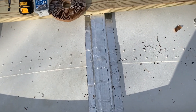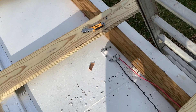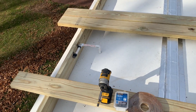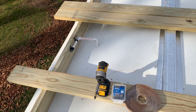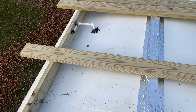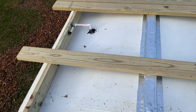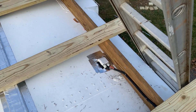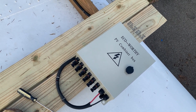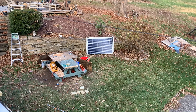It has butyl tape underneath and roofing screws, and I'm also putting a layer of roofing tape on top to seal it in. Should be watertight — hopefully. Then I've applied Henry's roof sealant flashing over that. Cable management runs over into the PV combiner box. It's all ready to hook up the solar panels, which are sitting there ready to go up on the bus.